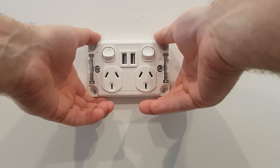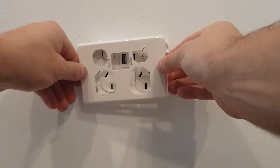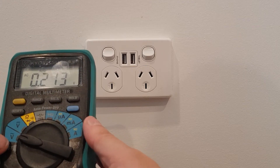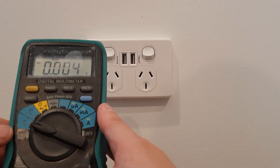Make sure your PowerPoint is fairly level and then just whack the cover on. So that's how you change the PowerPoint. Once you turn the power on, get your multimeter again, go to the AC symbol with the wave. Don't go to the other one because that's for DC, like for batteries and things.